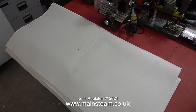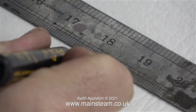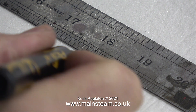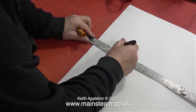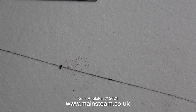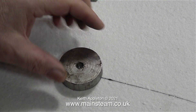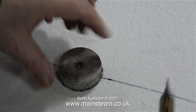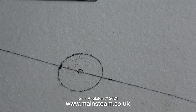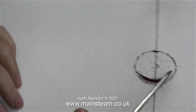Underneath the brass cladding is a much larger sheet of the heat insulation material. The first thing I need to do is know how big a hole to cut in the middle, and where to cut it for the steam dome. I'm using a felt tip marker pen to mark the size. I need to cut a piece of this heat insulation material which is 18 inches square, and the first thing I need is a centre line. The black mark that crosses the centre line is the measurement from the front of the boiler to the front of the steam dome. I went round the workshop and found a piece of aluminium with a hole in the middle, which makes it even better because I can see the line — it was more or less exactly the right size as the boiler bush of the steam dome.